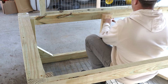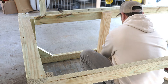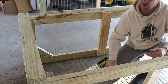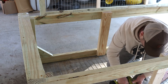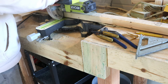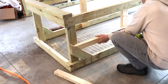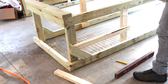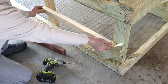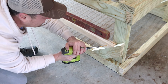It's 26 inches from the closest edge of that 2x4 — 26 inches over. So we cut two 24-inch boards, and at this point we're not using treated lumber anymore because we want to make it light. Treated lumber can be up to 50 percent heavier. So we're going to use 2x3s.